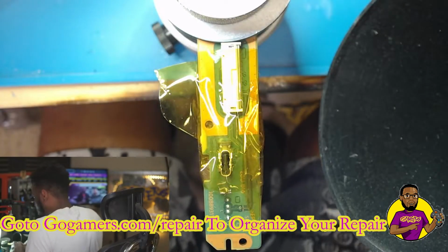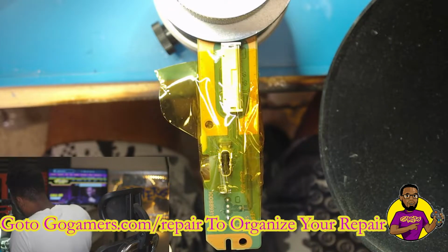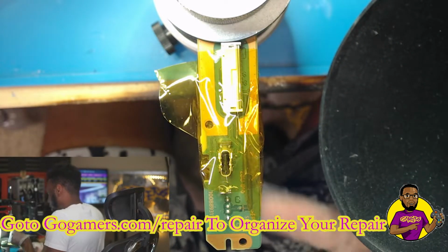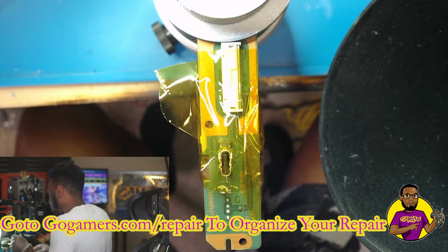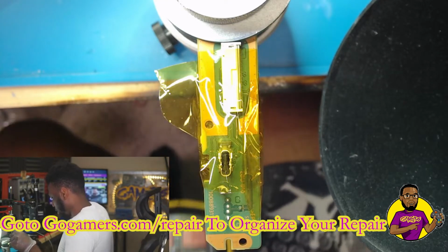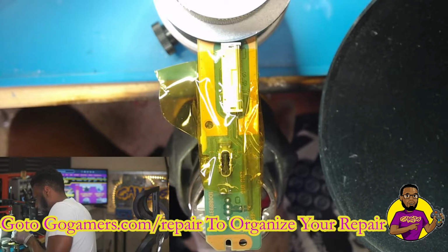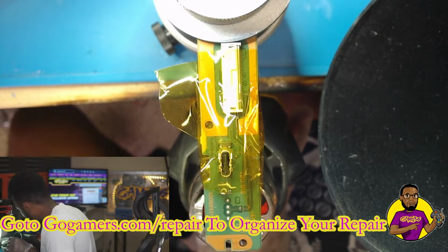And what we're going to do is we're going to use our tweezers. And coming in from using this one is a little bit easier because we can go from the bottom one a lot easier because, since it's at an angle, we don't need to go from up top. So it's a lot easier dropping it on there. So let's take our heat gun. Let's get this solder to flow. And we're going to come from up top and drop this USB port directly over there. So I'm going to wait until that solder starts to flow and melt.